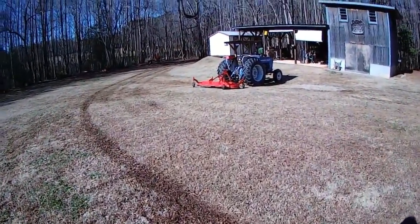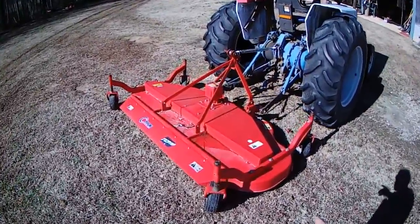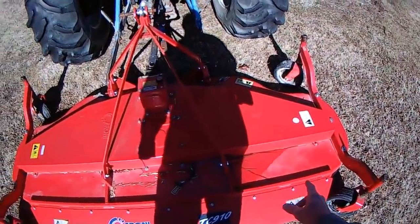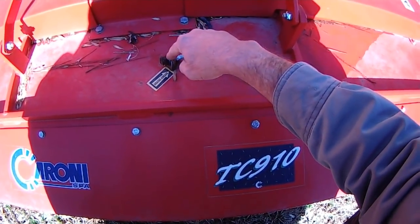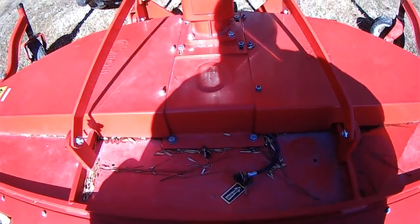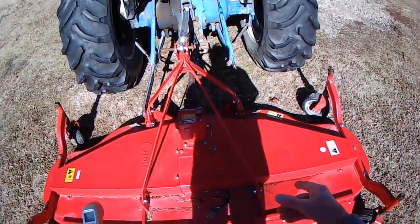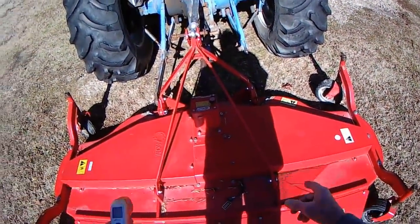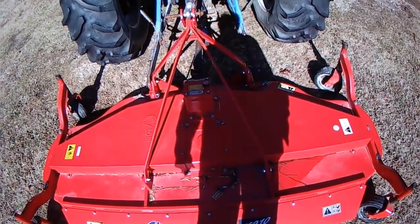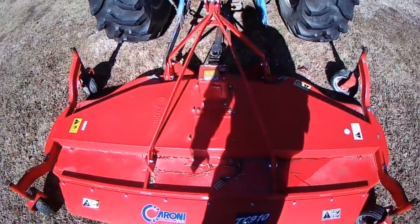Over here on this mower there's a bunch of bearings. Every one of the bearings on a blade — and there's five blades — they've got grease fittings. They did this thing right: they put an extension line on it so I can get to the fitting out here without taking the shields off to grease it. They did that on all five of them. But there are two tensioner pulleys with bearings in them, and those are sealed for the life of the bearing, which guarantees you'll have a short life. I can check them with this and see if they're starting to heat up; if they are, change them before something flies all to pieces.